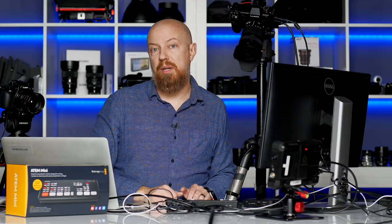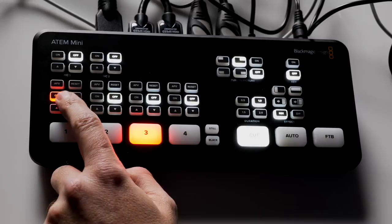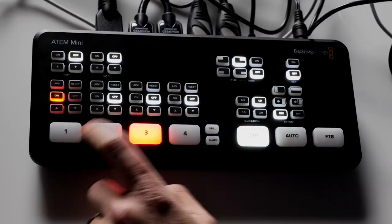Whenever you're going to have anybody talking on camera, you need to have their mic fed into the camera. Or you could plug the mic into a hardware mixer that has built-in delay. You cannot plug a mic directly into here and plug a camera in and put the two together — they will not sync up. Super important to know. You could still use it though for background music or background tracks — that would be a perfectly good use for that input.